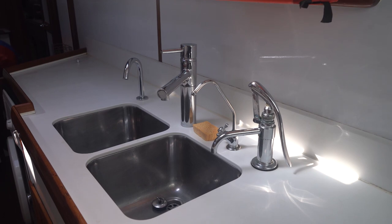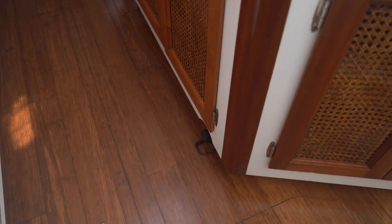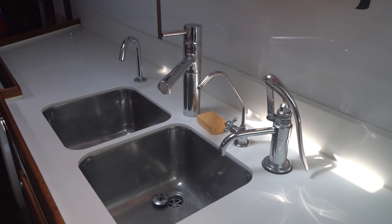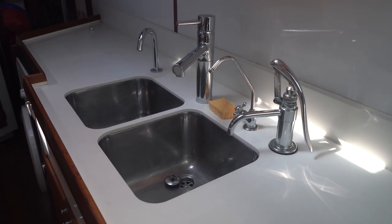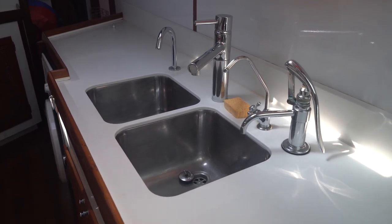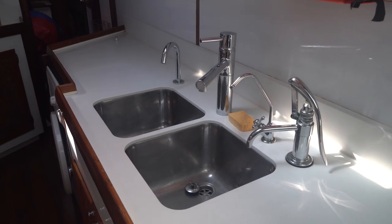Just to give the breakdown on the faucet system: there's a fresh water foot pump down below the sink edge — only as a backup if the electric pump fails. Then there's a salt water hand pump on the far right. There's a filtered water tap using household filters — easy to replace, hardware stores in Grenada carry them. It's a triple filter: sediment, fine filtration, and a carbon filter. Drinking water right out of the tap is going to be great.